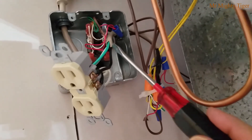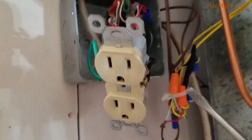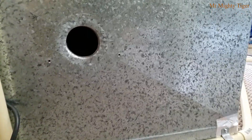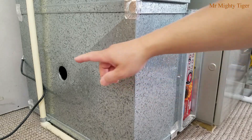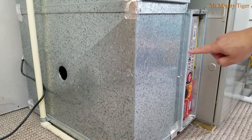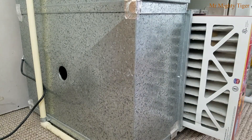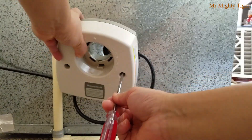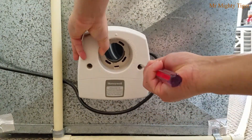The relay switches on the 110-volt power source, which will supply power to our UVC lamp. Here's the hole I drilled for the UVC lamp. The lamp must directly shine onto the air filter to kill any potential trapped bacteria and viruses. But the UVC lamp must be time-controlled — otherwise it will burn through the air filter elements if it's left on too long.